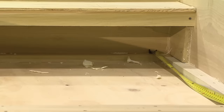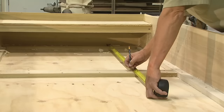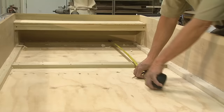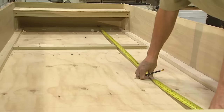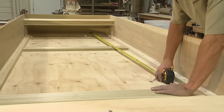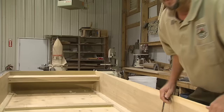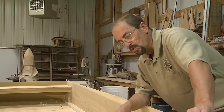To refresh where we're at — we're measuring from the back of the gunnel. This splice cleat that put our two pieces of plywood together is centered at 47 inches. Continuing the run of our tape, we're going to put the next one at 104 inches, right in the center. I'm going to place this board on both sides of that mark, cut it to fit, and scribe each side of that line so I'll know where to put the glue. The strips we'll put on the bottom in just a few minutes will give us a nailer point at the front and at that strip in the back, so we don't have any protruding screws coming into the bottom of the floor.